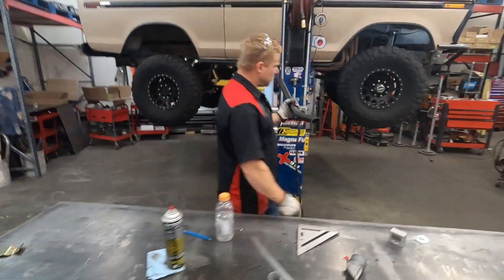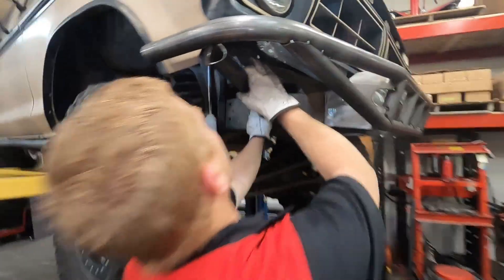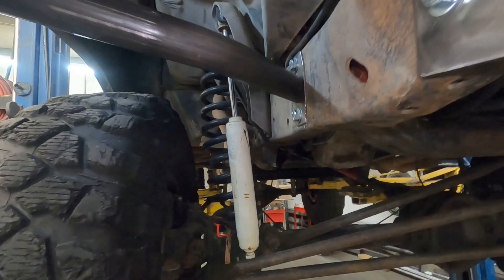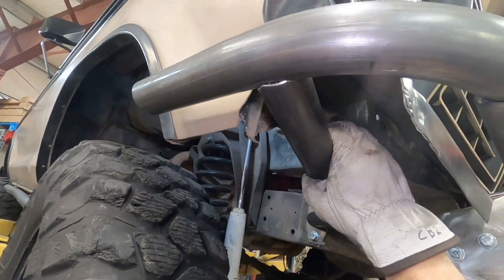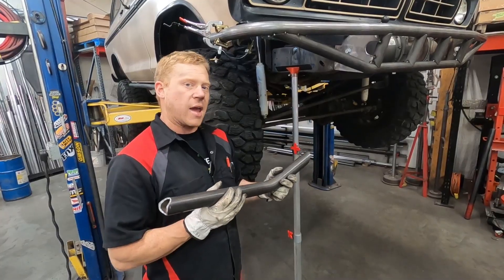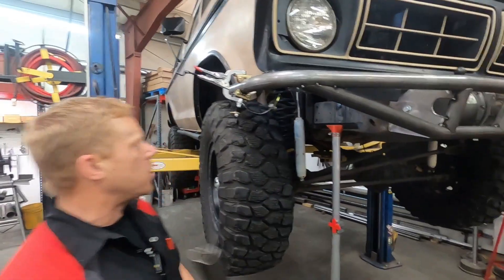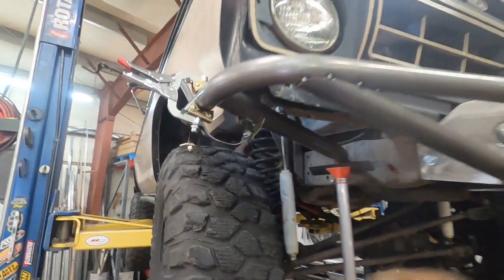Deburr, and now we go back and see how it fits in the vehicle. Just like this — centered, level — and there you go. That's how nice and easy it is to make a tube when you have the jig to copy. Now that this thing's fitting good, we need to tack it in place. Got one of our tube holders over here and a stand over here, so I can make sure it's got that final fit on it. Okay, that's basically where it needs to be.